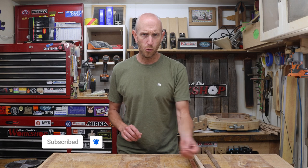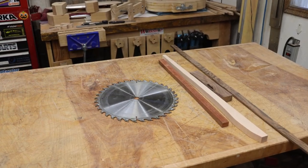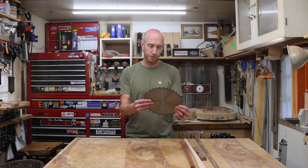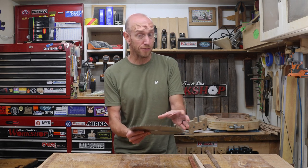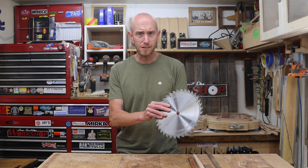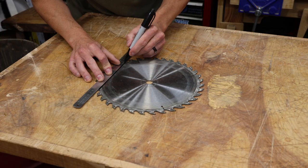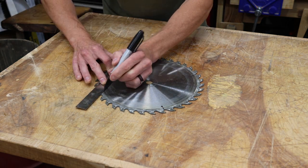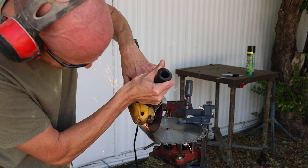I'm going to try using this table saw blade to make some plane irons. I figure it's hard enough for a saw blade — I've seen lots of knives made out of table saw blades — so let's try making some plane irons. I'm going to make these irons a half inch wide, so first I'll lay out a couple of lines to help guide my cuts, then I'll use an angle grinder with a cutoff disc to cut these down into just over half-inch wide strips.